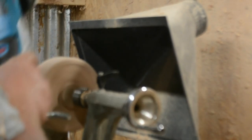We'll get a fresh bit of, come on, where does it say it? Well, that's 80. We'll just go right at 120. One thing I found with this stuff is this 120 sanding like this gets it a lot smoother than you would think. Way smoother than 120 normally would. So now we use power sander.